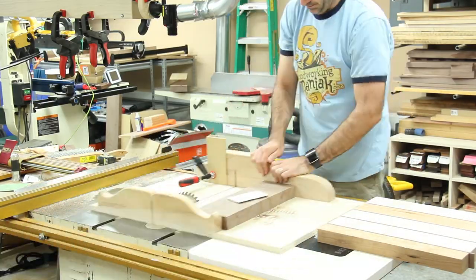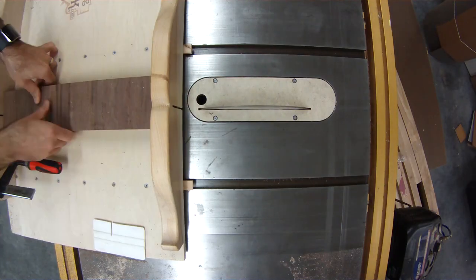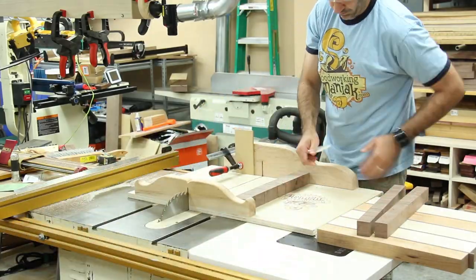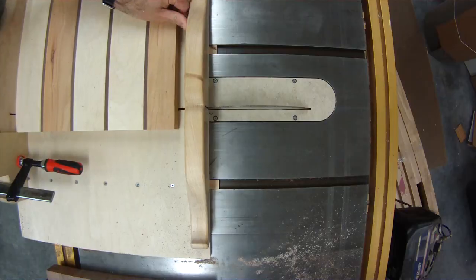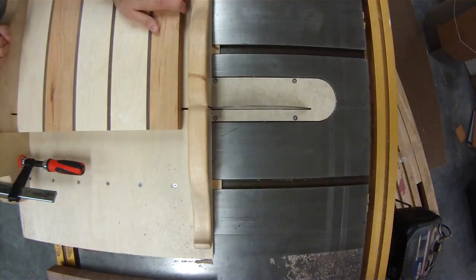Because I'm actually cutting these into smaller strips, it just made it a little bit safer for this sort of action. So I cut this into three strips. This way it allows me to flip these to the side so I can actually get end grain pieces out of this walnut. Then I cut the rest of the strips for the other glue-up as well.